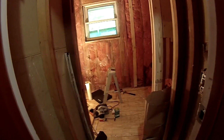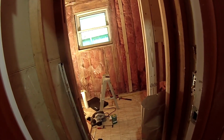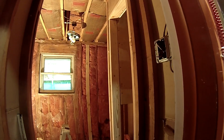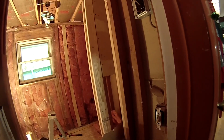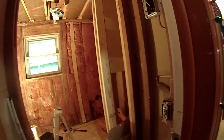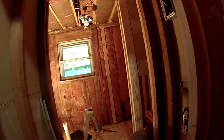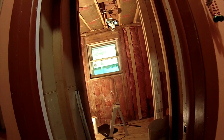Okay, new day. Finished the subfloor. That's done. Reframed the closet so that the sides are even with the walls so that I can install drawers and make that a cabinet with slide out drawers so you can get to the back. Added a support beam for the tub and surround. And today is dealing with the ceiling.